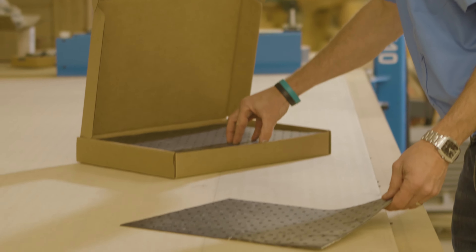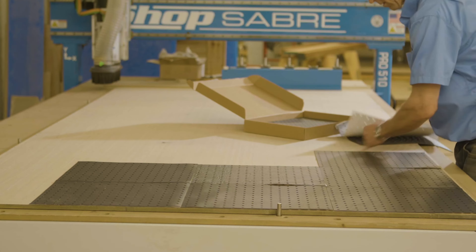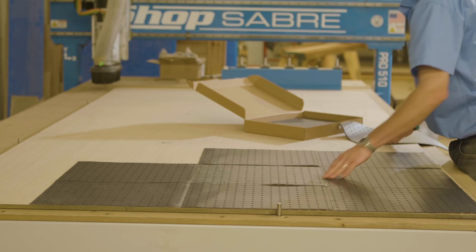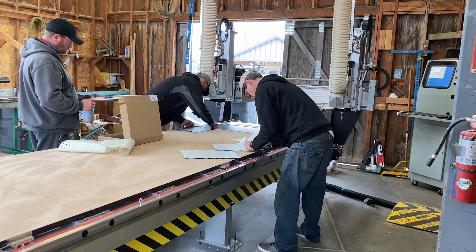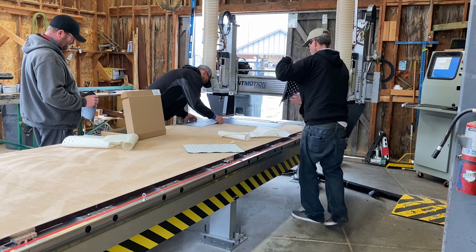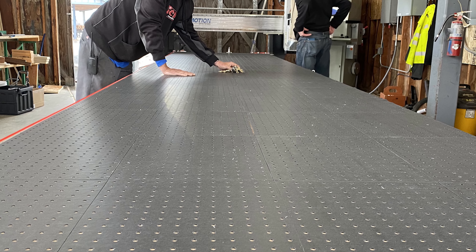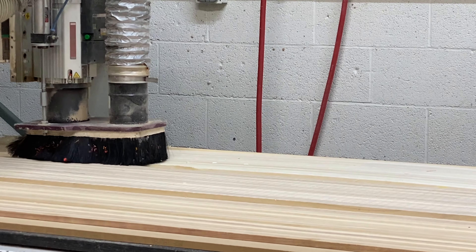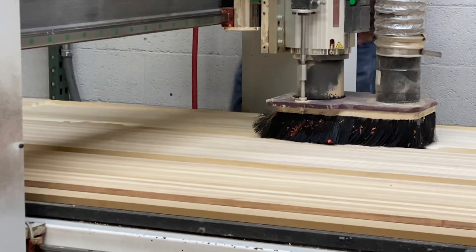The nested base tile gasketing is the latest offering from All-Star. For years, nested base customers have told us they need an ability to hold their parts but have no time or desire to add gasketing to their process — and I understand that. So with our tile gasketing, we've supplied sheet material with perforated holes that a customer will cover their entire board with, providing universal downdraft assist as it captures vacuum and eliminates vacuum loss.